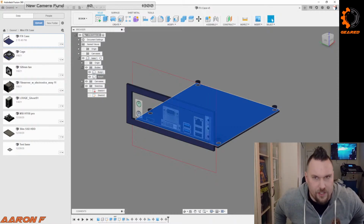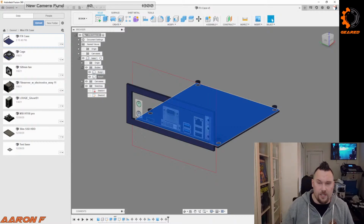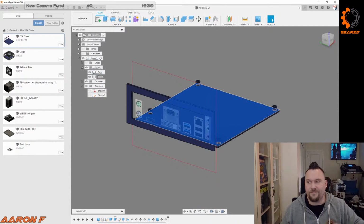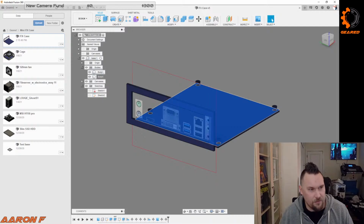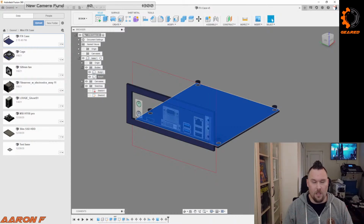I feel like there's got to be a way to use a different file format, but it may just be because of the screen size he chose. Maybe if he had chosen a smaller screen size, for other people that maybe actually want to watch this stream, which we'll see. What Ryan's talking about is when you're in RepRap firmware, the PanelDue lets you do a boot screen, but what we could find is very specific requirements. You have to use a bitmap, it has to be the right size, it has to be 24-bit, and it has to be less than a certain kB. Well, those things don't add up to working.